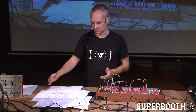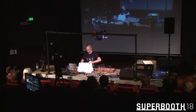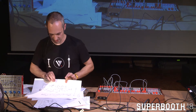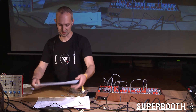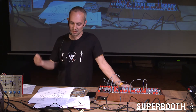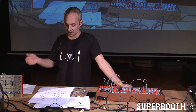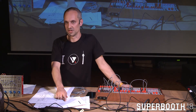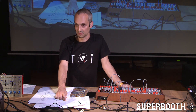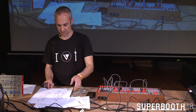The version patented by RCA — the converter technology is identical, part for part, to what Don used. In their text they say it was good between 50 Hz and 15 kHz for frequencies coming through it, with clock frequencies from 50 kHz to 800 kHz, and that it could get roughly 60 dB of signal-to-noise ratio — which, if you know anything about pro audio equipment, is absolutely horrible. It's like a BBD or maybe even worse than a BBD. And when you put eight of them in series, it's absolutely unusable.